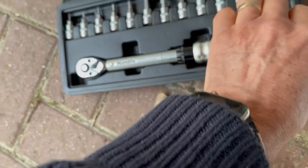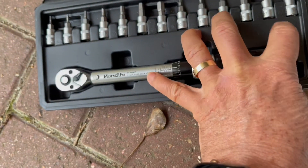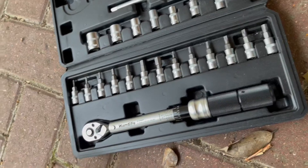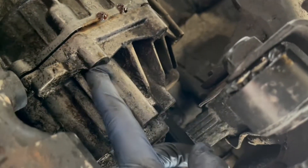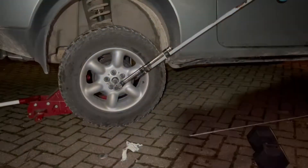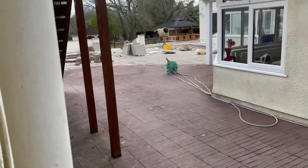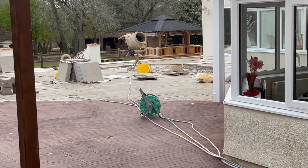The very last thing to mention: before you put the torque wrench away, always back it off to zero or below zero on the torque setting. That avoids loading the internal spring under constant compression, which could push it out of calibration over the years. Thanks for watching — there will be more Freelander fixing videos coming soon, as well as some others. I've been busy on a patio project which has taken absolutely ages — probably the subject of another video at some point. Thanks for watching, bye.